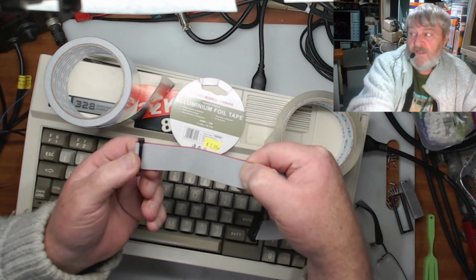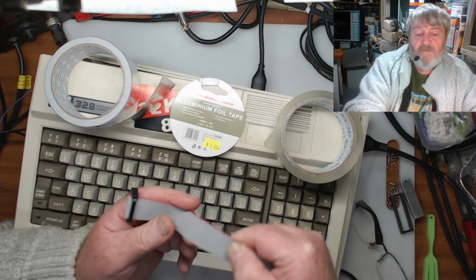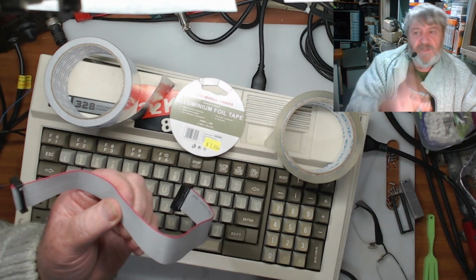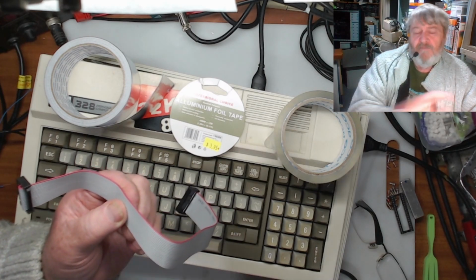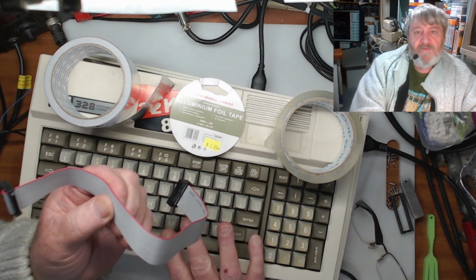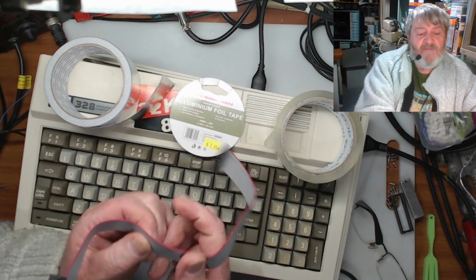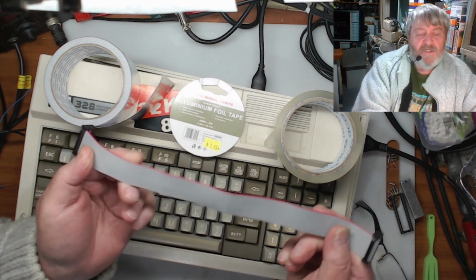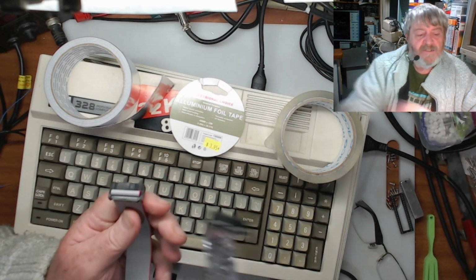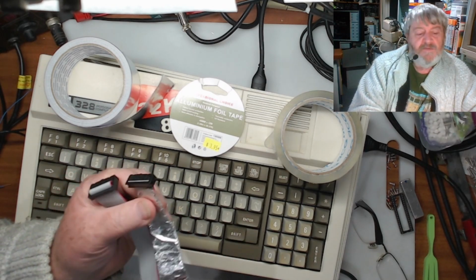And that was about there. And that was about as long as you could go with them before you started having issues with noise or no picture. Because it would come up with a boot screen, but you wouldn't get the picture of the boot screen of the PC. You'd only get the Tang Nano boot screen. And I found out that it was interference on the cable with the length. Because he would say to me, you need to keep it short because there is a problem with the frequency with the length.